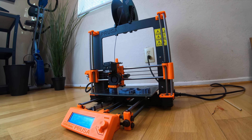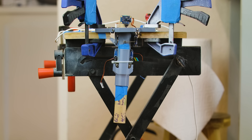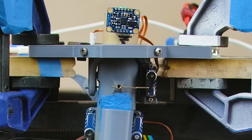This 3D printed thrust vector control mount has just too much slop in the joints. If we look at high-speed footage of the mount moving to 5 degrees, we can spot a lot of wiggle and bending, especially in some of those linkages.